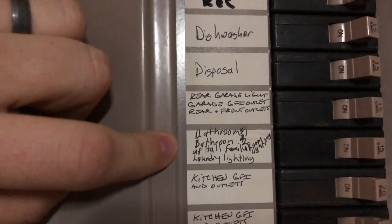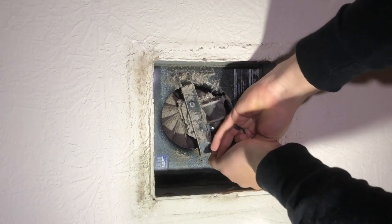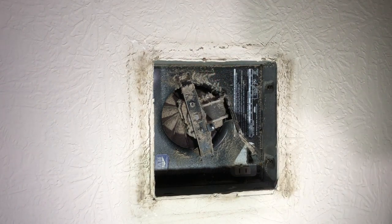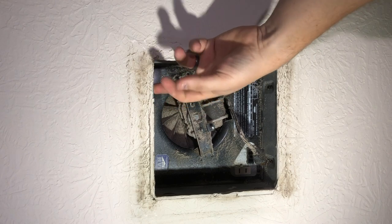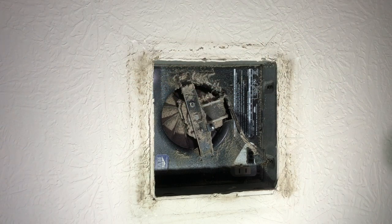I actually kind of got the whole outlet pulled out, so I want to make sure the power is off for this. Make sure your switch is off and then go out to your garage or wherever your electrical panel is to find the fuse box. Open it up and search through — I'm guessing it's going to be this one right here that says bathroom number one, bathroom number two. Since there's only two bathrooms, you'll just flip that. Now that there is no power in this room, I did pull this outlet out, which is not good — that is just an outlet that comes in and out. I'm going to push that back up, and it did go back in. You can probably see why we were having some issues — look how dirty this is. We're going to try to clean it from the base and see if it helps out.